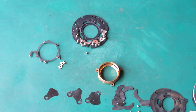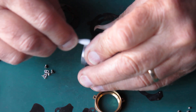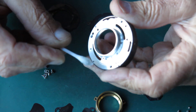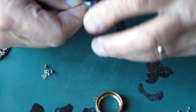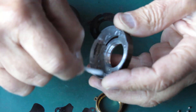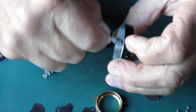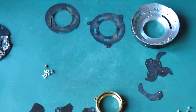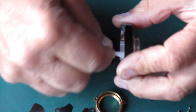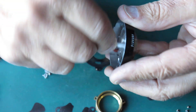I can start the process of cleaning and reassembly. I'll start cleaning up these shutter parts, starting with the case. That's coming off pretty clean - which tells me there's not a lot of oil on that case. I've got to clean the inside of the case. My usual start point for these shutters is to start with the case and the diaphragm, then move to the mechanism plate after that.